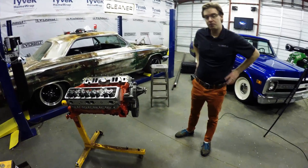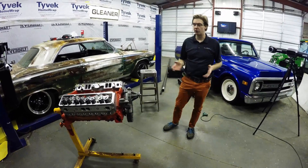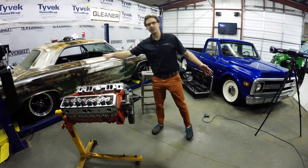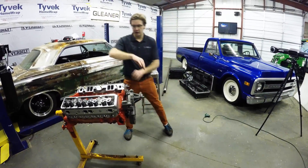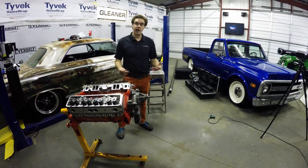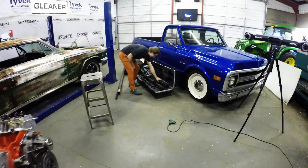Because the C-track sees a fixed volume, it also gives us really high volumetric accuracy. We don't have to worry about tolerance stack-up per meter of distance we're scanning — everything that's in the volume, it knows the size of. So we get really high accuracy data. It's more flexibility and more accuracy.